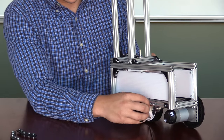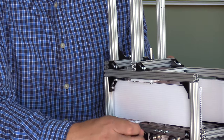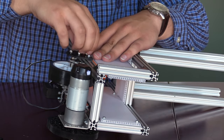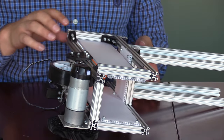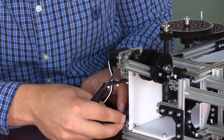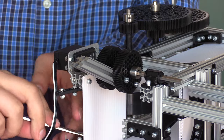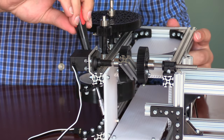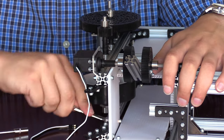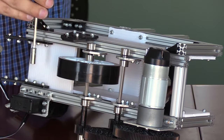In order to mount the shooter to a drive base, we will take the variable angle bracket and slide it onto those 3 screws that we left available to ourselves early on in the build. For now, we will allow this bracket to slide freely as we will need to adjust when we mount. The next phase is we will take each of the 150 degree brackets and slide them onto the inside bottom parts of extrusion. These will be screwed down tightly making sure that the extrusion exactly hits the peak of each of the brackets. These will be used to mount the shooter at a 60 degree angle. If you want a higher angle, you can modify yours with one or two of the custom angle brackets in your kit.